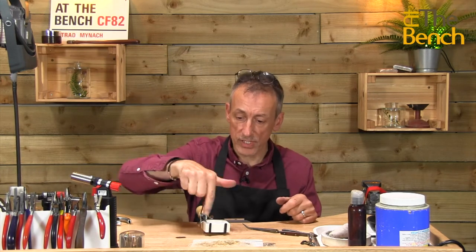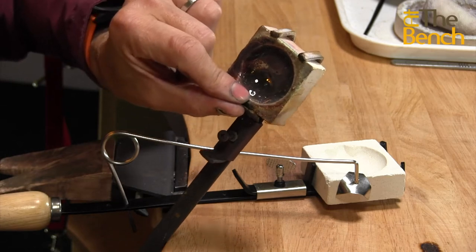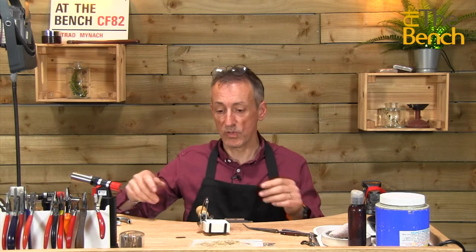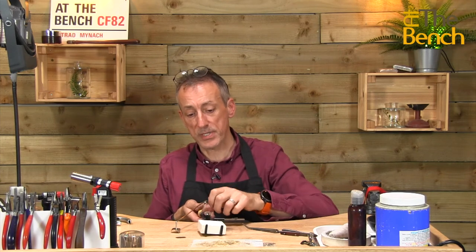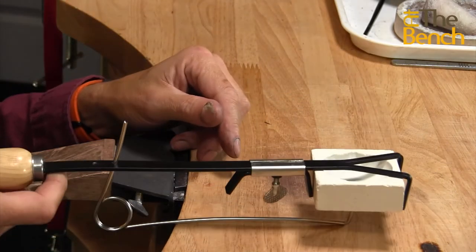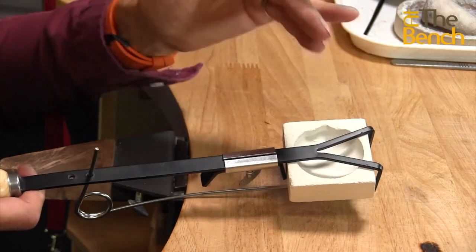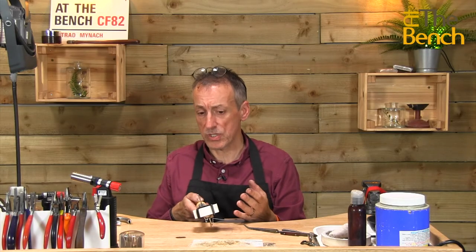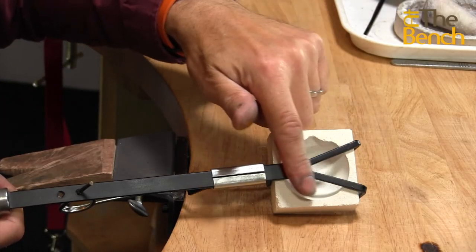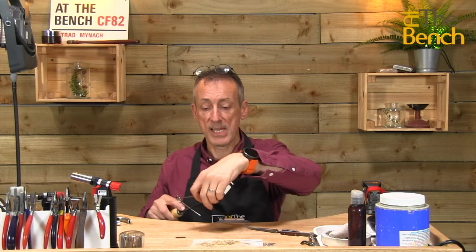Always take care not to swoosh your metal around in the crucible too much - you don't want metal going onto the steel part. Perhaps have only one little claw just coming over to hold it in place. If you're only doing silver and sprinkling flux onto the whole area, you may find the flux gets coated all over the crucible and over this slider part and the little claws, so it'll hold onto the crucible and it won't be inclined to move back and fall. You may see pictures of the crucible upside down, but my concern with that setup is the whole area gets hot in direct contact with the flame and heats up the handle too much.